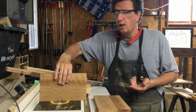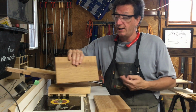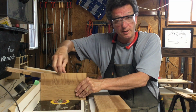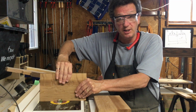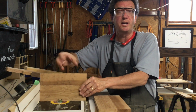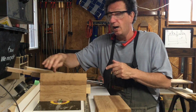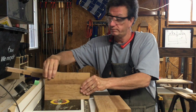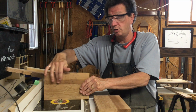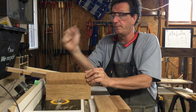Thing is, I need to make, of course, 8 grooves and for 4 sets. So I'm going to spin the piece after I make each cut. So there's one, make the second. That way the cuts are nice and symmetrical. But after each set, I need to move the bit relative to the piece to make the next one. I want like a 1/2 inch kind of tooth.